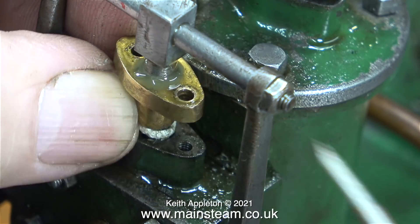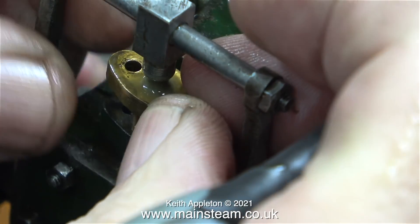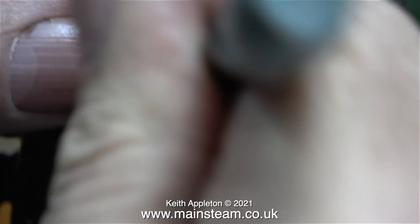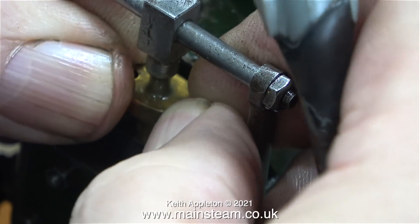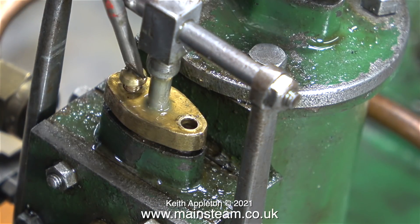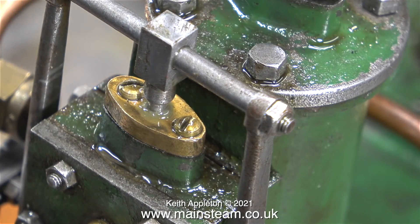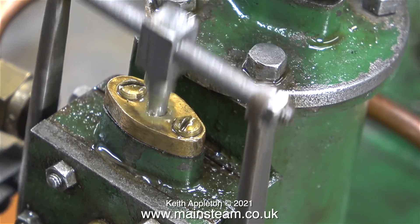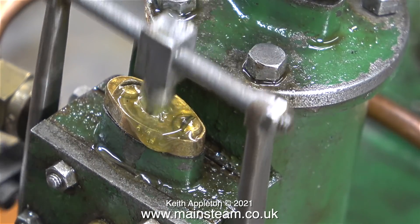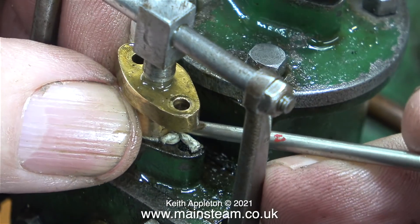The reason for this is that the hole going through into the steam chest has been drilled too big for the diameter of the valve rod. If I carry on adding more packing and tightening the flange, what's going to happen is the packing at the bottom will start to be forced through the gaps in the hole into the steam chest. This clip shows me temporarily refitting the dome head brass screws to see whether the gland packing does its job. The best way to tell is to run the engine and apply some oil around the gland — and as you can clearly see, the oil is bubbling around the top of the gland, so this hasn't been successful. I will give it some proper attention when I dismantle the steam chest.